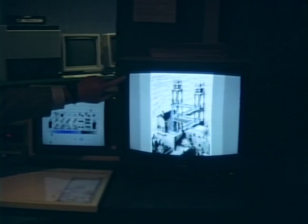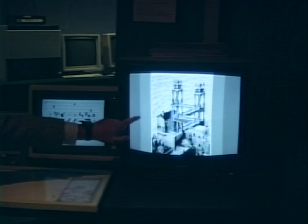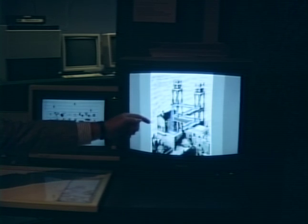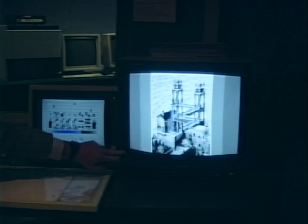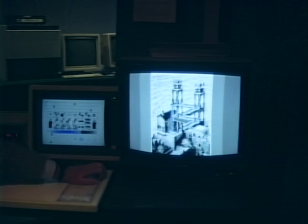What's stored in the computer's memory is an array of numbers representing points on the television screen. Each number in the computer's frame buffer memory is assigned a particular color or gray level, which then becomes a dot on the screen as the television raster scans that picture out. We made this frame buffer to be compatible with standard television, unlike most computer displays. So we can tape record it or use it in broadcast television situations — it's compatible with TV gear.